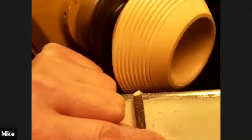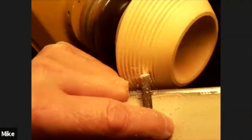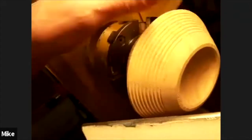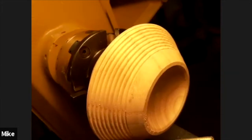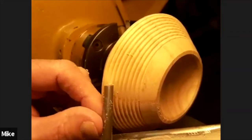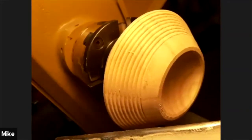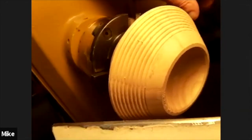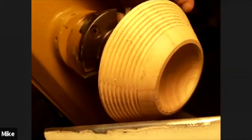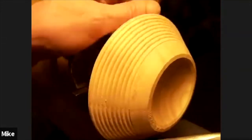You could use a skew if you go straight in at 90 degrees, but the problem with a skew is you're running in a long grain/short grain direction, and sometimes you'll catch that long grain coming around and the skew point will skate right across all your work — it doesn't look so good. The other thing about the D-Way tools is the fact that they seem to run very true on the wood — they don't jump around, they don't go anywhere. That's why I got it.